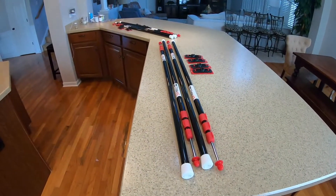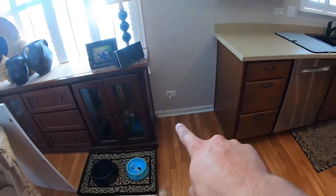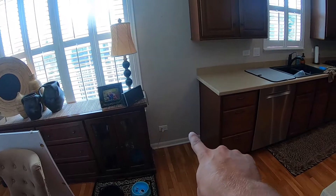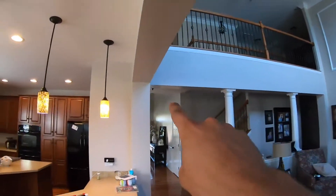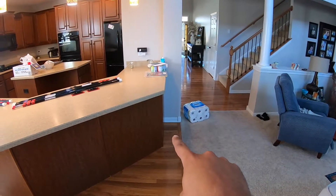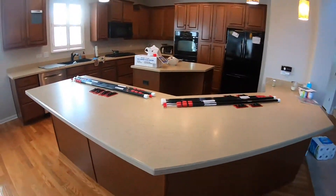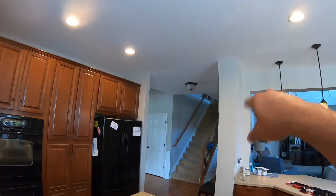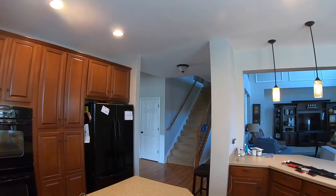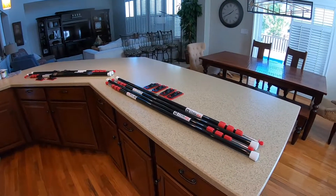So I have eight zip walls here. I think I'm going to build the zip wall starting on this inside corner - give me room to work on these ends. We're going to run down to here and then run across. I'll probably just have to take the wall down to do work on that little spot there, but I'll deal with that when I get there. I'm going to put the entrance to the work area on this side with just two zip walls. It should be pretty simple and straightforward. So that is the before - now we will start setting up the zip walls.